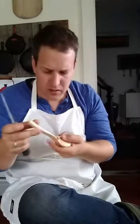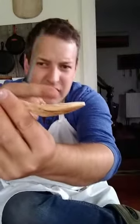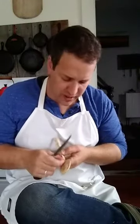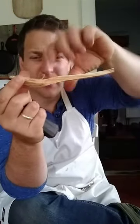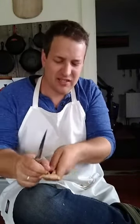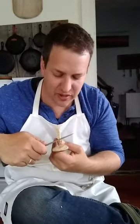Here. Good, good, good. Notice how I left this attached here. I did not try to go back and forth trying to clean that up, because then you'll end up overcutting right here in the neck. So you want to do it as a thumb push going down to the bowl, and then either go like that and just tear it out by hand, or leave it attached. But don't come back in this direction trying to clean it up, because you're never going to.